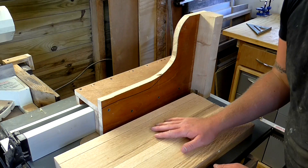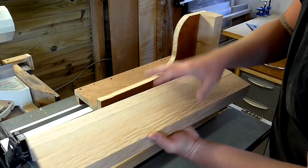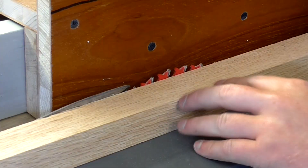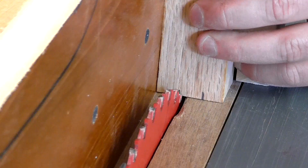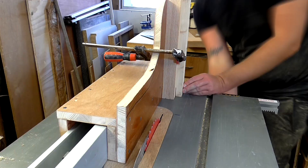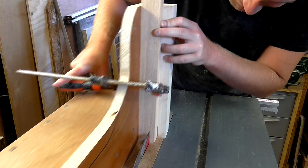It's time to make these cuts for real now. I'm first going to cut the mortise joints on 4 pieces, both sides, and then cut the tenon joints on the other pieces, both sides. I adjusted the blade height to the thickness of the material, lined up the blade with the inside of the mark, and made the cuts to form the mortises on both ends of 4 of the 8 workpieces.